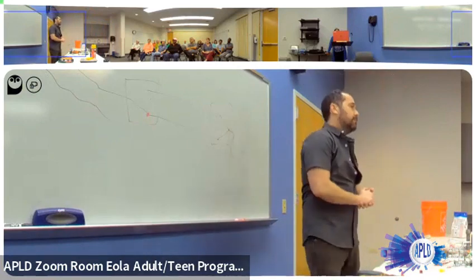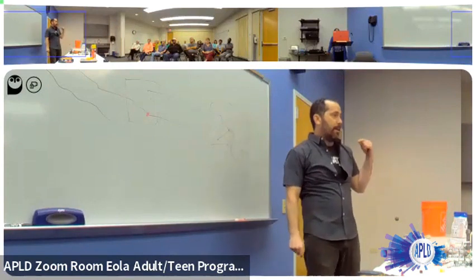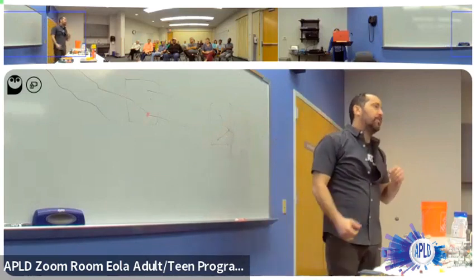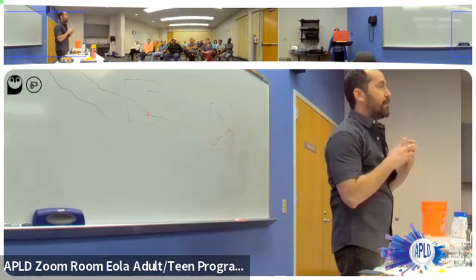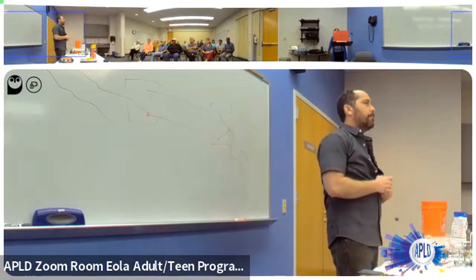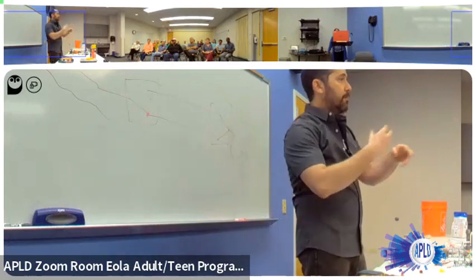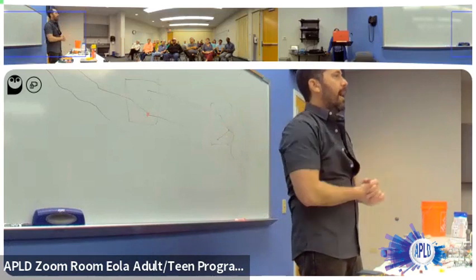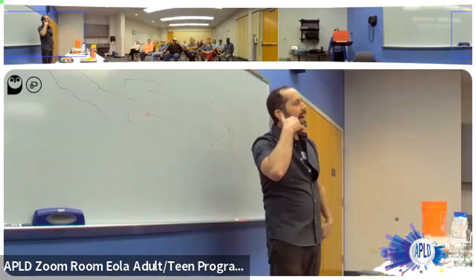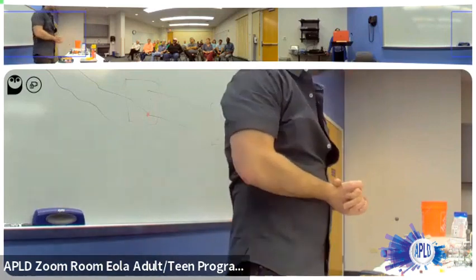I think that would be fine. My guess is that one of these devices has failed on you and this is reparable. Be aware that you may open it up and go, oh, stuff's cooked, okay? Especially if you encounter a box that is just crammed full of wires, or because it is old, if you're dealing with cloth-wrapped wire. I'm not telling you you can't touch cloth-wrapped wire. Just know that as you start working with cloth-wrapped, sometimes the insulation just falls the heck apart, at which point you may want to go, hey, I started this job already, okay? But yeah, I think if you just replace those with two new three-ways, you're going to be fine.